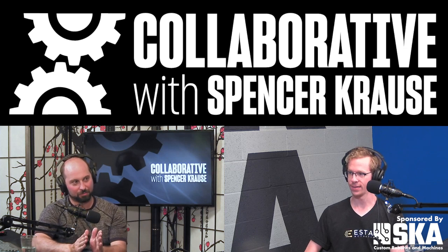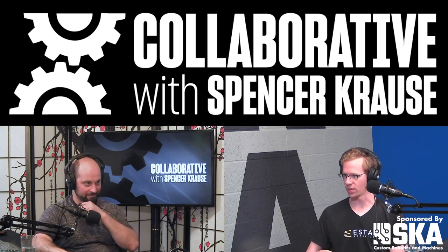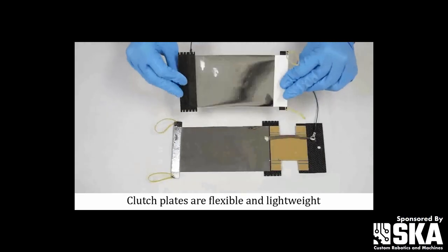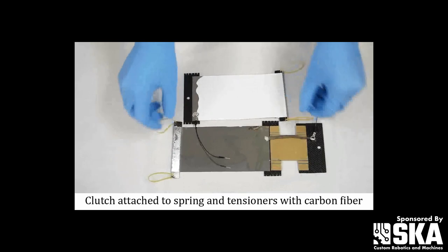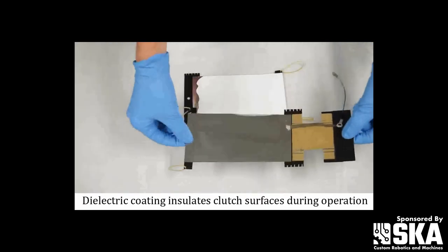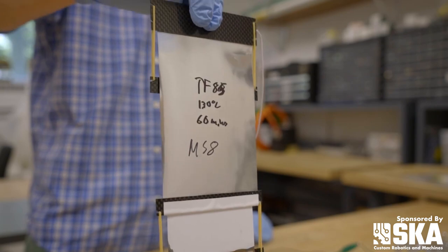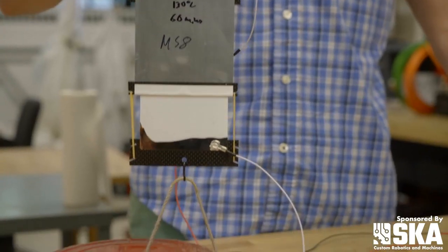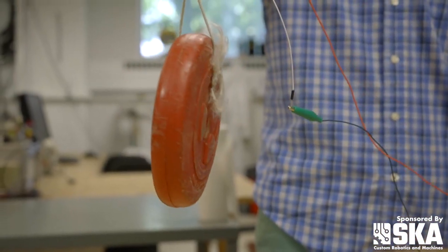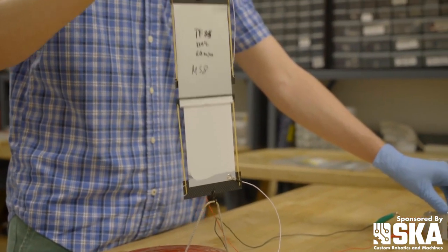Is that because you've got like two parallel plates? Exactly — it is a capacitor. Think about a thin film capacitor: unfold it down to one layer, and the construction is an electrode, dielectric, and electrode. Cut it down the middle, so now you've got two electrodes that are separate and can physically move relative to one another. Apply a voltage across them and they adhere from basic electrostatic attraction — positive charges on one side, negative charges on the other. In any thin film capacitor, it's squeezing the dielectric, but we essentially cut it in half and take advantage of that force across an interface.